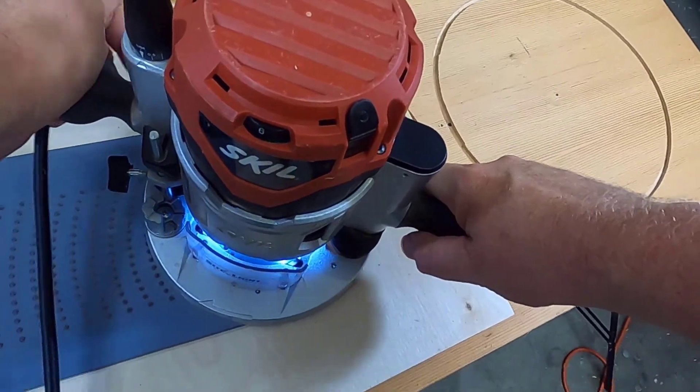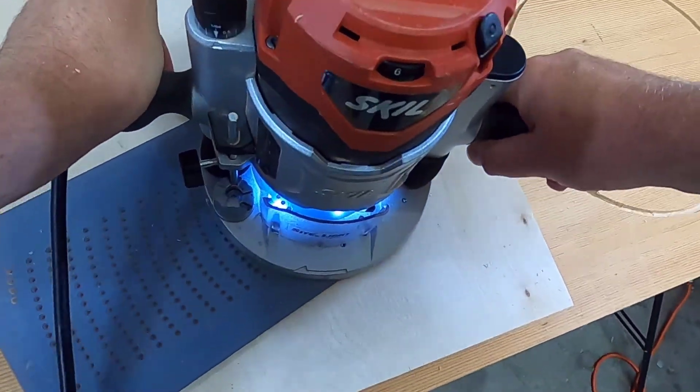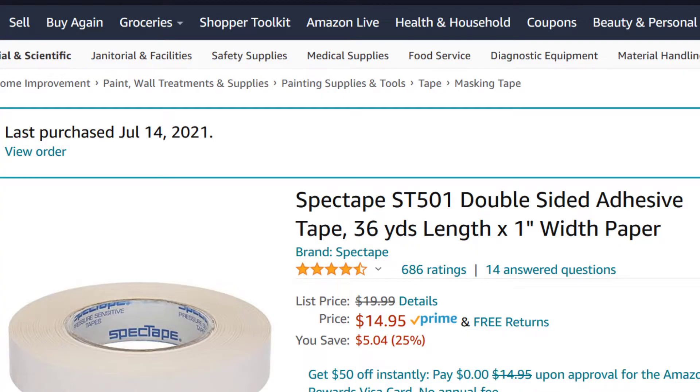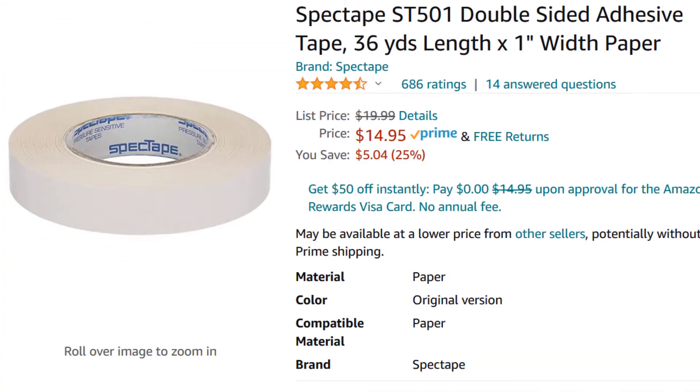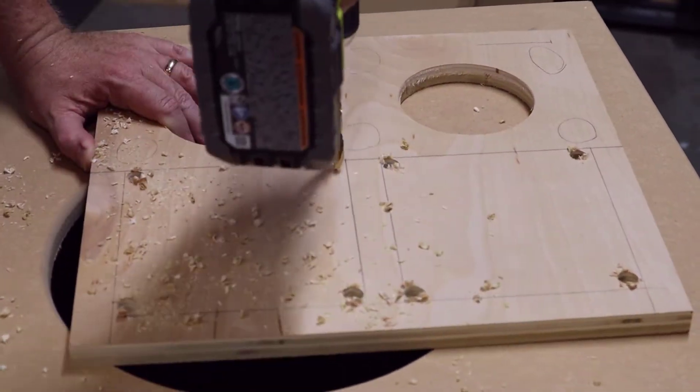While I've got the router jig out, I'm going to go ahead and cut the hole for the terminal cup in the other end piece. When I cut these circles, my typical method is to clamp a spoil board down to my workbench and then tape the piece to that spoil board. Now I'm going back to the brace to cut out those windows. It's a pretty straightforward process — I just drilled out all four corners of the window, then grabbed my jigsaw and cut those out, staying along the lines.